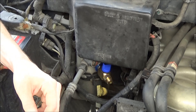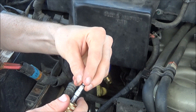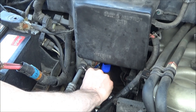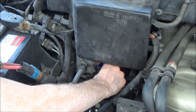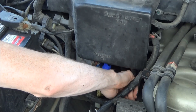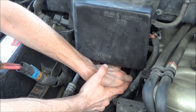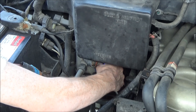We'll go ahead and get this new valve put in. Put it in the same way — just put your schrader valve in, there's a hole in the middle of it, stick your stem into it. Go ahead and tighten that on. Now open your valve back up, slide your tool through, keep pressure on it while you tighten it up. You don't have to turn that valve off or anything, just go ahead and disconnect it.